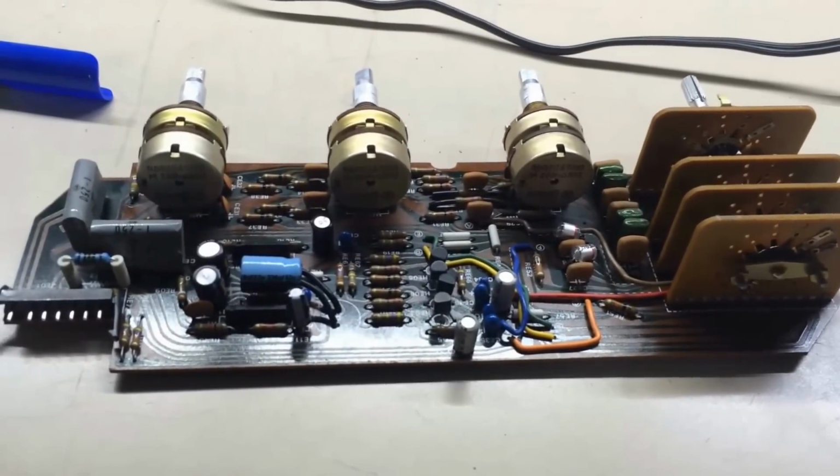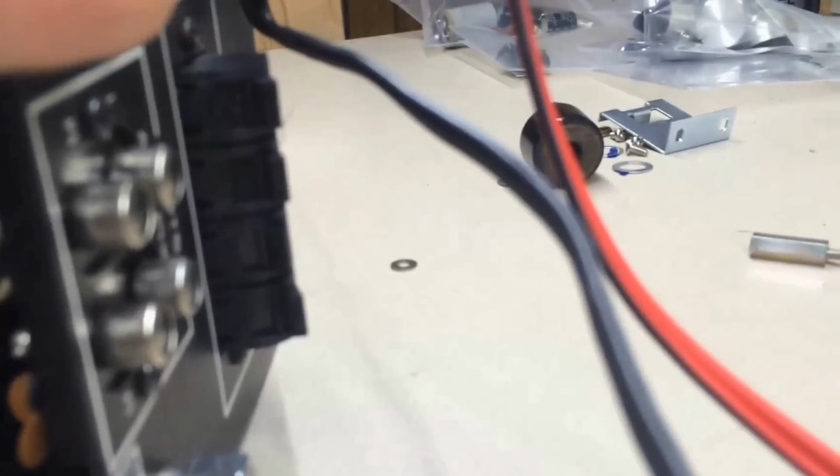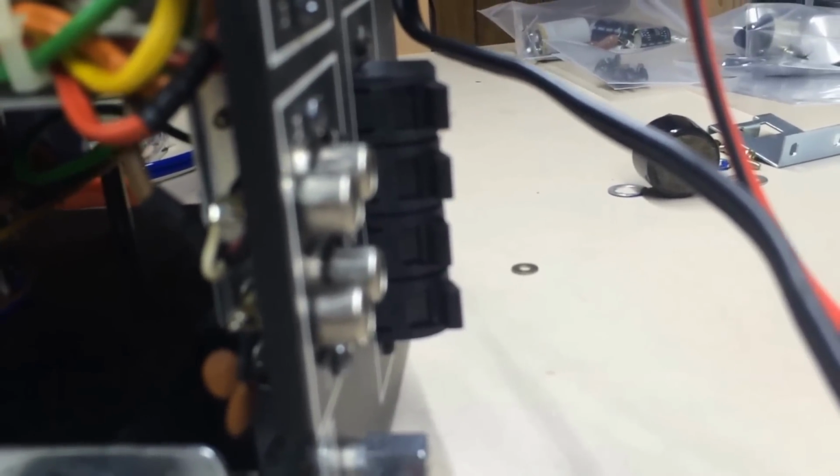What I noticed was when I turned it on and put something into the auxiliary ports back here, I wasn't getting any sound out of the speakers. I was scratching my head on that and played around for a few minutes, and I ended up pulling the two jumpers you'll see on the back. One goes to the pre-in and one goes to the pre-out.